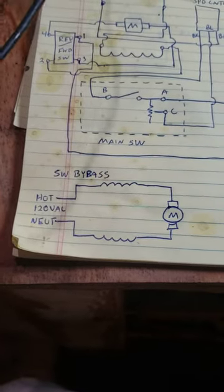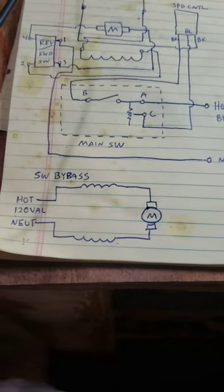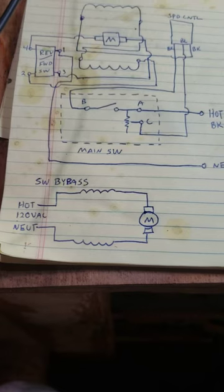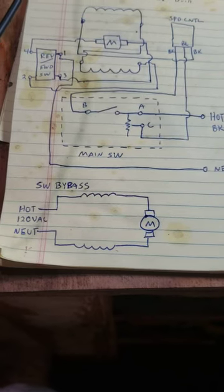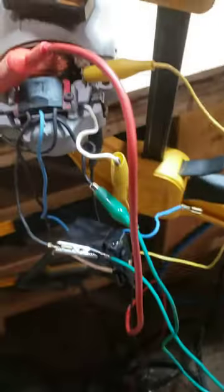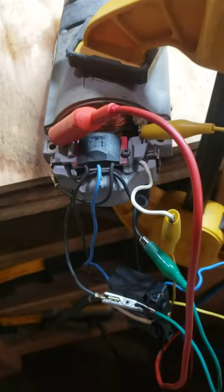Your hot goes to one winding and then to one side of the brushes of the motor, and out the other side of the other brush, through the coil, and back to neutral. I gotta be careful because that's my power coming down there — I don't want to fry myself. Once you've got this all connected, take your plug right here and just plug it in.